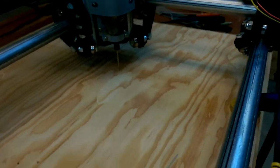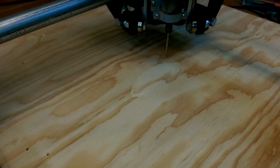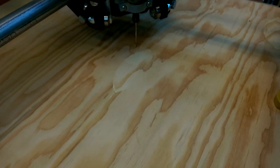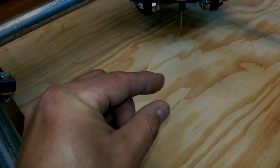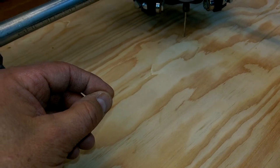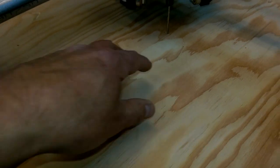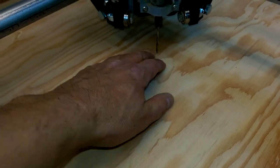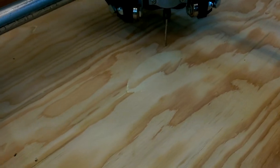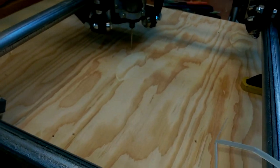I've got the back of the carrier board up. I just wanted to try this new path plan that I did on Fusion. We now have three millimeter depth of cuts for the hogging passes, and I brought the feed rate down from 800 to 700 millimeters a minute. The chip load is at the very tip of the bit - ideally you're supposed to have more of the bit engaged - but we'll see what that looks like.